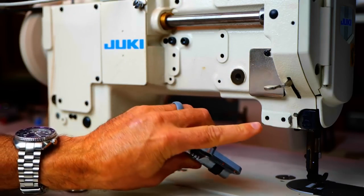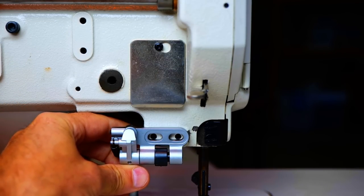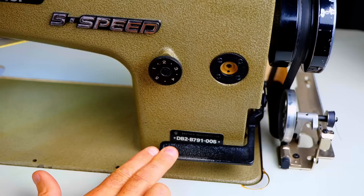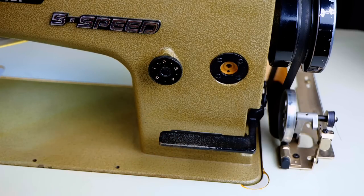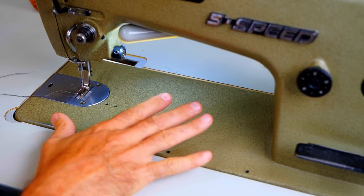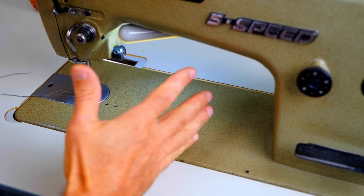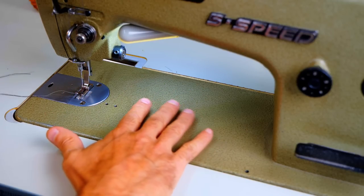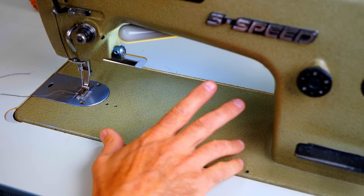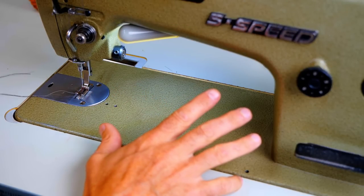In order to mount a guide like this, your machine needs these two threaded bolt holes and it mounts on just like this. So what if on the back of your machine you don't have the two mounting holes needed? Some guys drill these out and tap them. I'm probably not all that comfortable doing that. There are workarounds that work very well, so it's really not worth the risk in most cases to drill and tap your machine. If you want to do that and you're going to use that flip-down guide enough to justify it, go for it.